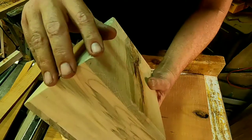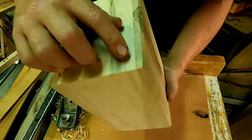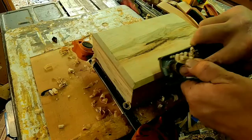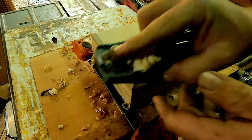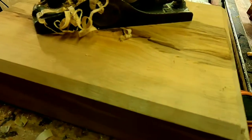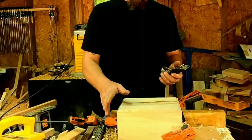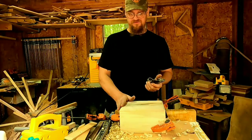So now we've got all our sides to match up. There's a little tear-out there — I might go at that the other way — but all our corners match up. We're about halfway down the line. I'm going to take it to halfway, so I'm going to go at this again off camera and meet back with you. And now that I've got the chamfer all even with the angles roughly at 45 degrees, we're going to start smoothing the transition over to the lid.